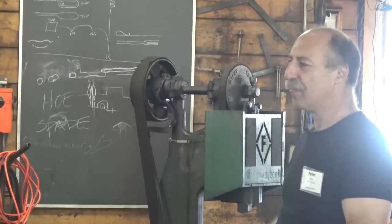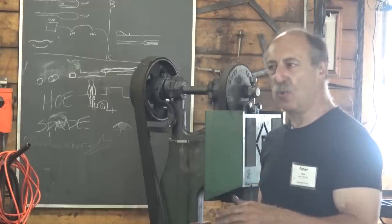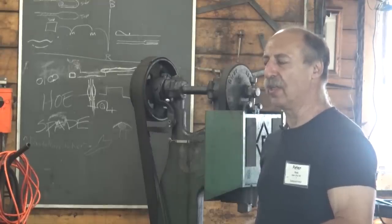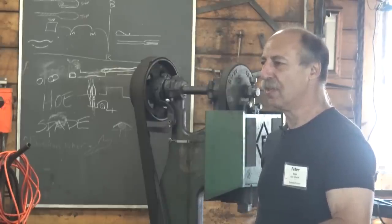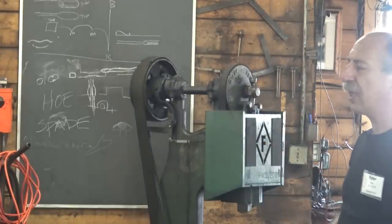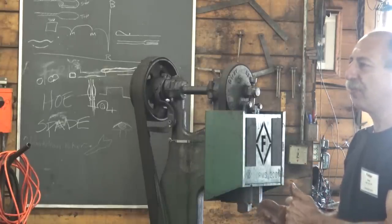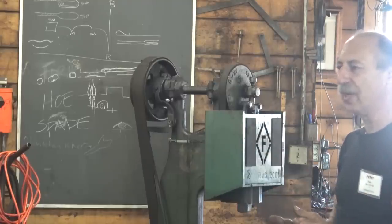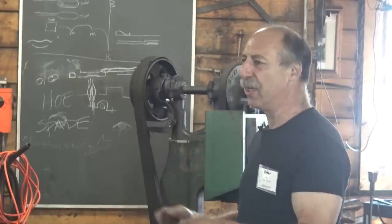But if you did the cast steel, you probably lose the grain. No visible, you know, laminar grain. And if you make shear steel out of that blister steel, you still have grain, visible grain in the steel, more evenly distributed. So if you really look at old iron and tools a lot, you can find tools that are marked shear steel. And if you etch the steel in those, you can see the grain that looks like wrought iron grain. But really that blade is steel, got carbon in it.